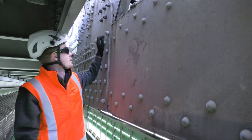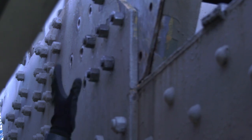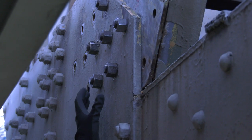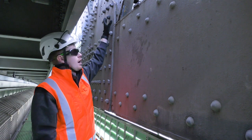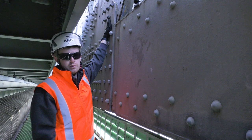As you can see, these new bolts have been put through. This plate has moved around 65 millimeters from where it should have been because of the impact — it operated under tension, slid out, and sheared through the 12 bolts that were holding it in.